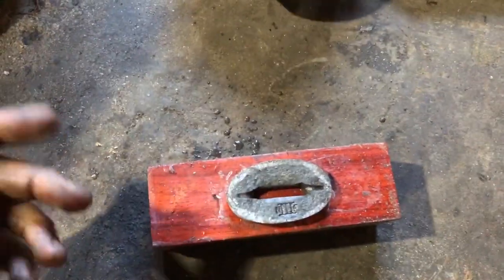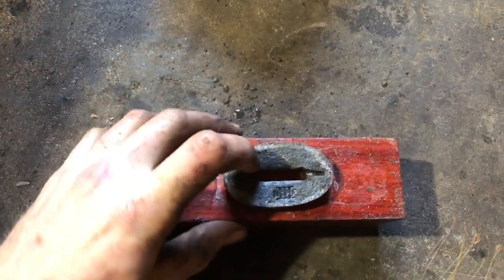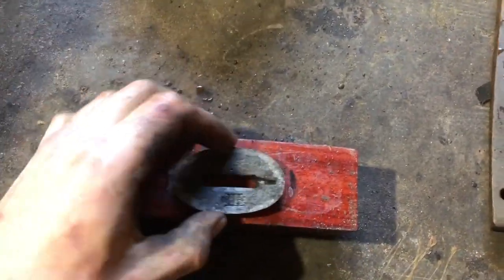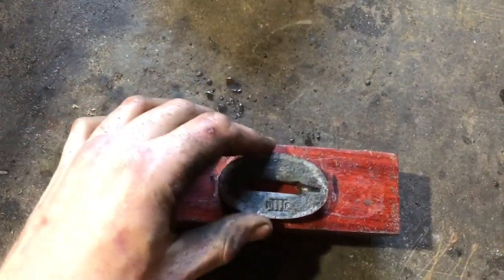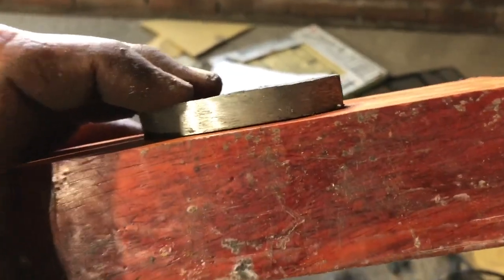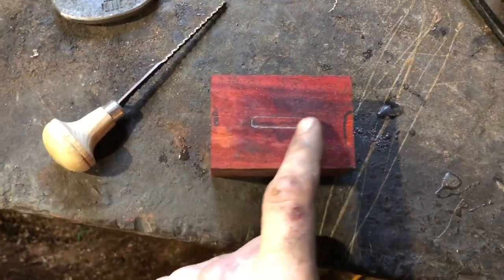Got the guard roughed out. Now it's time to start working on the first wooden bit of the handle. Your metal and your wood both have to be perfectly flat. A lot of times when you buy turning stock it has wax on it to keep it from drying too fast on the shelf, and that's not a flat surface, so it can lie to you about your fit-up. First thing we're going to do is run it through the table saw and take a blade off to get a relatively flat surface. A surface grinder would be nice but I don't have one. We'll dress up the fit, cut off the excess, drill some holes, and start broaching.